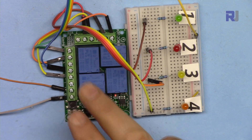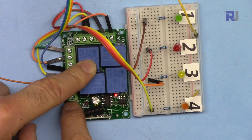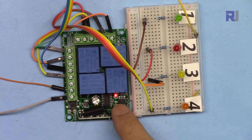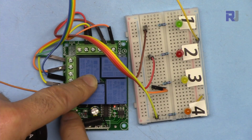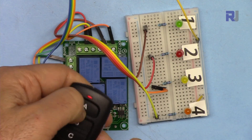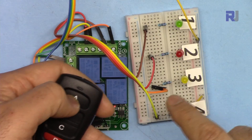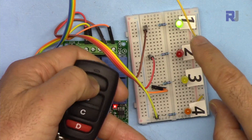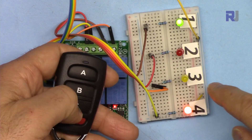Clear again by pressing eight times until it blinks. Mode 7 is latch and latch. Press the button seven times then press any key. After three blinks it's done. Channels one and two operate as one latch group, and channels three and four operate as another latch group — within each pair, only one channel is on at a time.